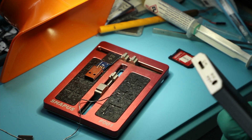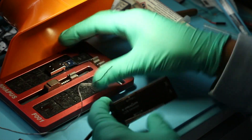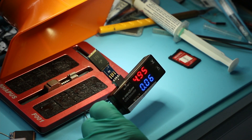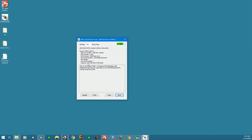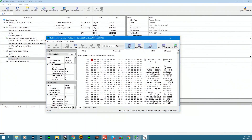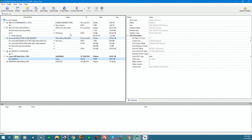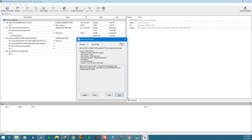That's it for soldering for now. Let's connect the USB stabilizer and plug that in. If we power on the unit, we're getting 60 milliamps. Looking in the log, our device mounts — it's 29.8 gigs. Running our studio software, we have a Lexar device showing up. Going into hex view to make sure everything is reading — this is FAT32 and there is actually data on this device. This isn't critical data because it's the donor device. We'll power down the unit; this was done just to confirm the donor piece is functional.